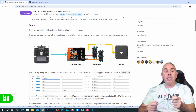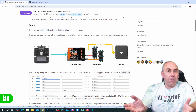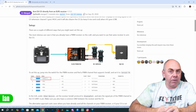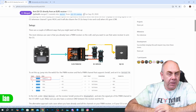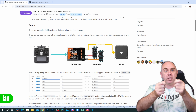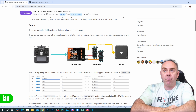The nice thing about this function is if you're a fixed wing user, for instance, you can use one of the ExpressLRS PWM receivers to control your aircraft and then use the dedicated UART port to set the MSP DisplayPort arming command. This means you don't actually need two separate receivers. You could also simply use this on a ground-based vehicle using a standard ExpressLRS receiver. As shown on screen, you can do this in more complex setups — for instance, fixed wing, using the Super P14 channel receiver, with your servos and RC control on PWM channels, and MSP DisplayPort arming on a spare UART.